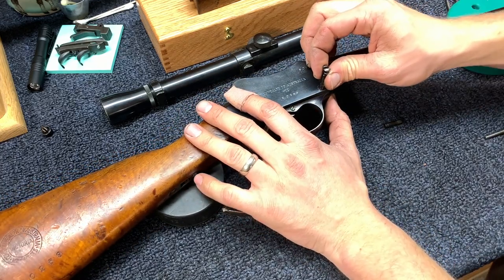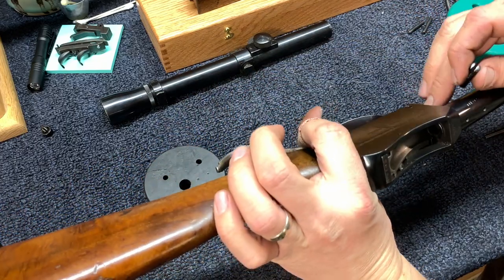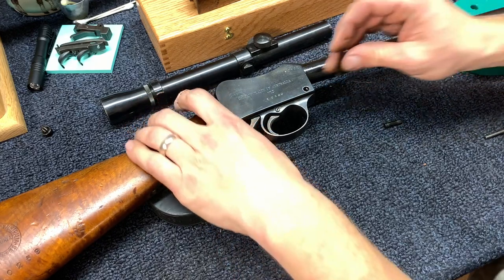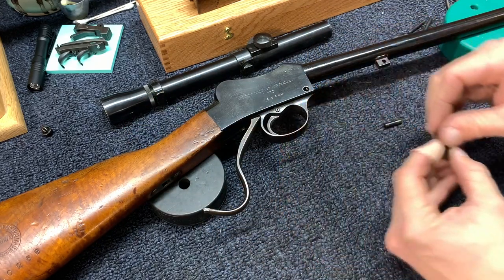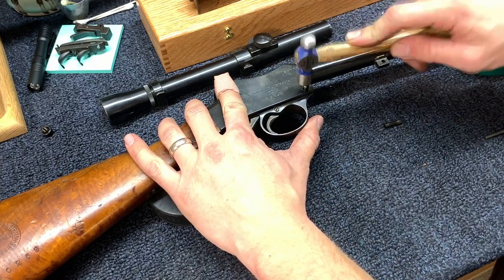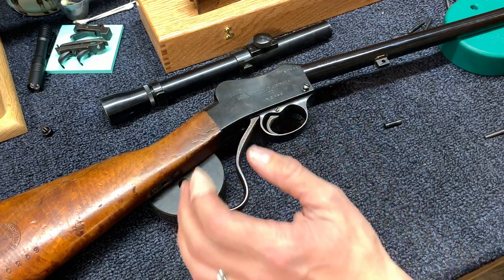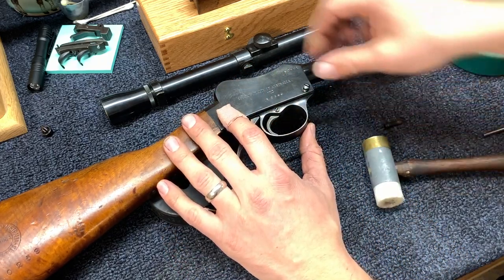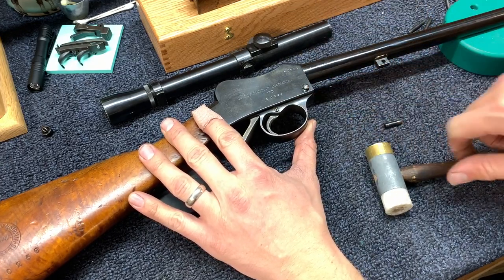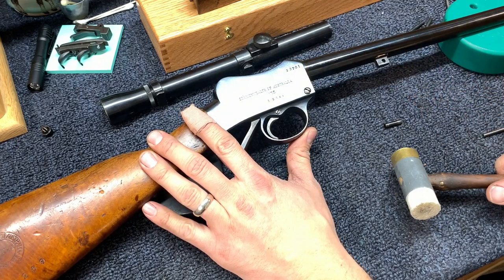So now the split pin. And if you look inside there, you can see the little grooves. So this side doesn't have it, but if you look in on this one, there is a little groove to accept that split pin collar. Now, as I'm pounding this in, I'm gonna switch to a polymer hammer just to be easier on it. Watch how that screw head kind of, see how it pinches together to get into that hole? And then splits back out.